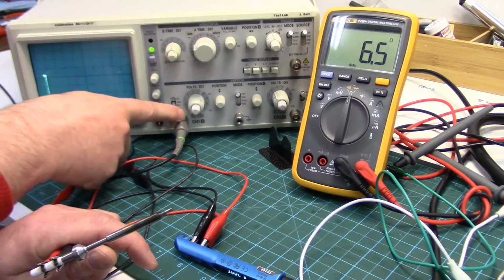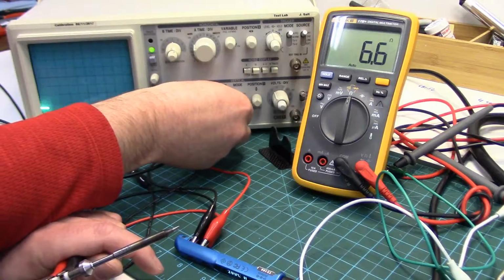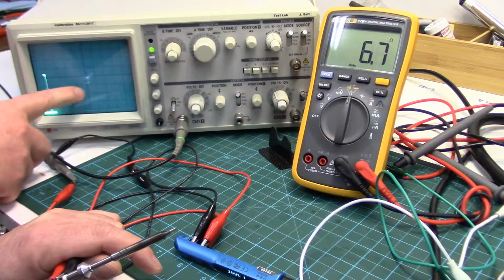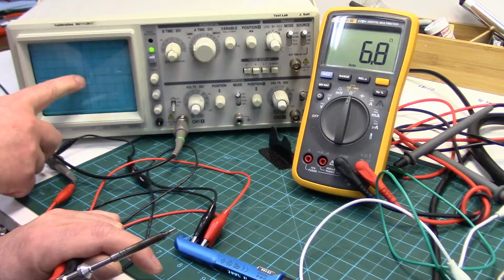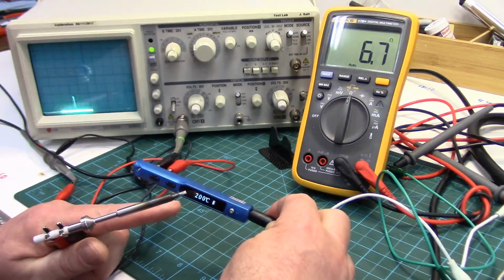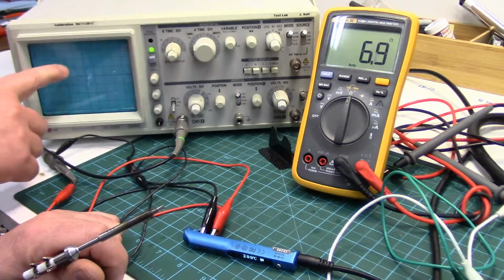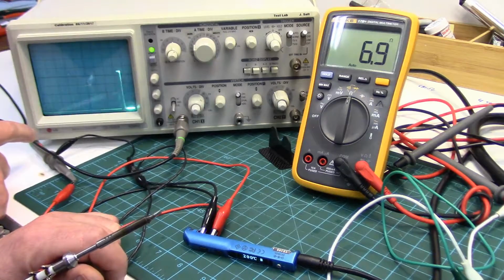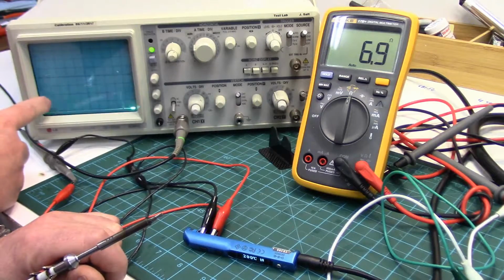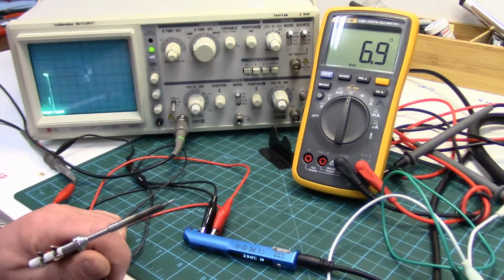And we can determine that we're at 5 volts per division, zero at the bottom. Let's just make sure we zero out our position there. But you can see 5, 10, 15, 20, and maybe 2 ticks, so around 22 volts. And right now it's maintaining the temperature. I've just got it set at 200 Celsius. And we can see there's short little pulses, 0 volts, short little pulse, 0 volts, and we're at 5 milliseconds per division. So roughly 5, 10, about 12 milliseconds it refreshes.